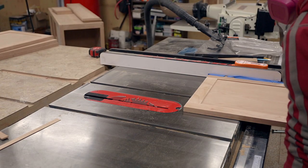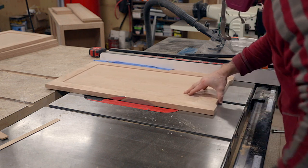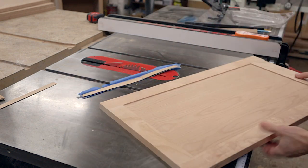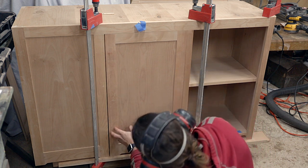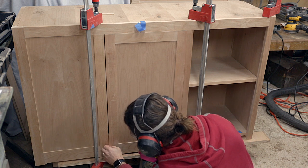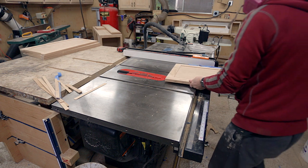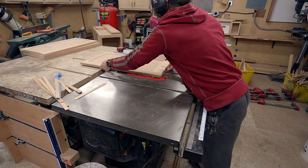You'll notice I'm not using a guard for the cut, but I do use a splitter for a little bit of safety, and I'm taking very little off at a time. I want to watch it as I'm doing the cut to make sure it's cutting right by the line, and if not I'll stop and adjust. After I do a cut I remove the tape and shims, sometimes marking with a pencil because I'll probably be taping it back on to cut a little bit more. I take the door back over to the cabinet and see how well it fits up — I'll shove it against the side I'm trimming and check if the lines are tight. I can visually tell if it needs more on one side than another.